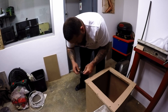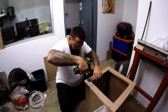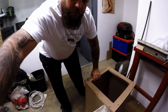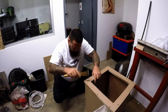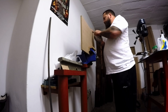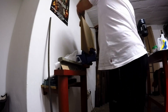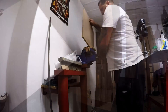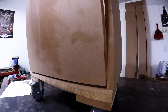The top hinge pin will just get dropped into a hole drilled through the top into the door, and I'll leave just a little piece sticking out so that I can pull it out if I need to. Onto some filing — I think I'll speed this up some more because this is like watching paint dry. Once I'm done I can start with final assembly of the door, along with a magnetic catch to keep it closed.